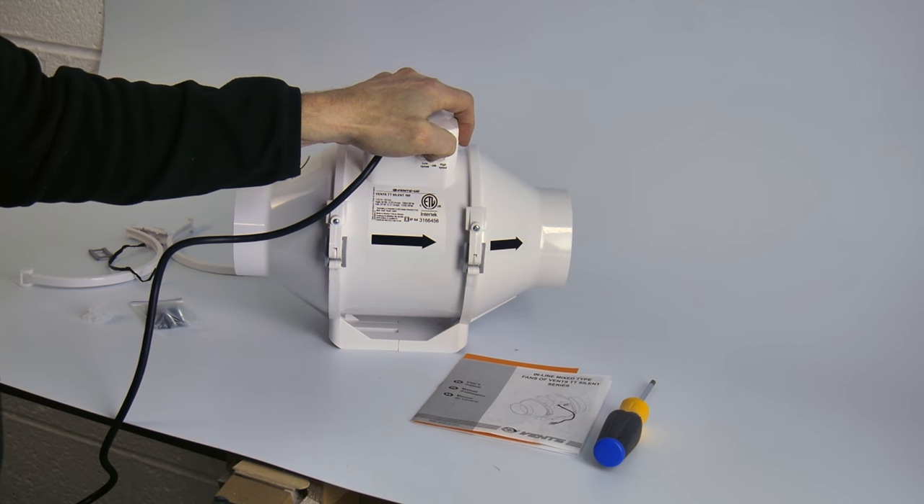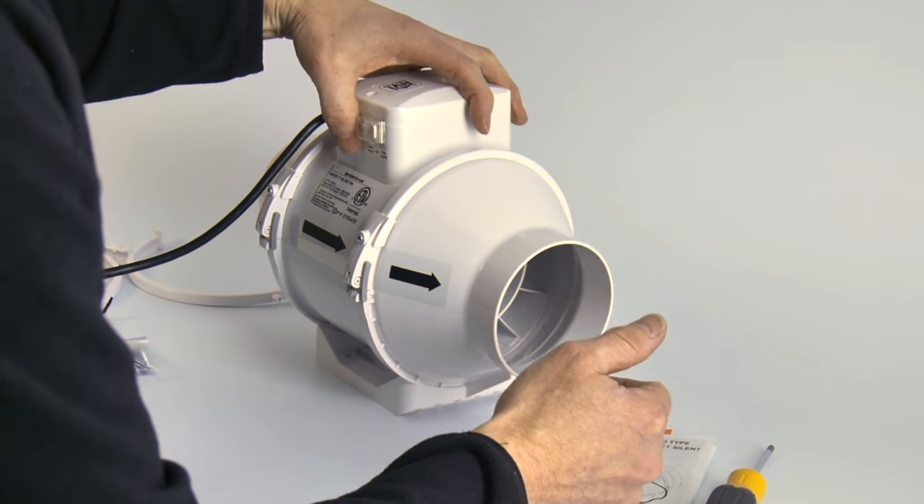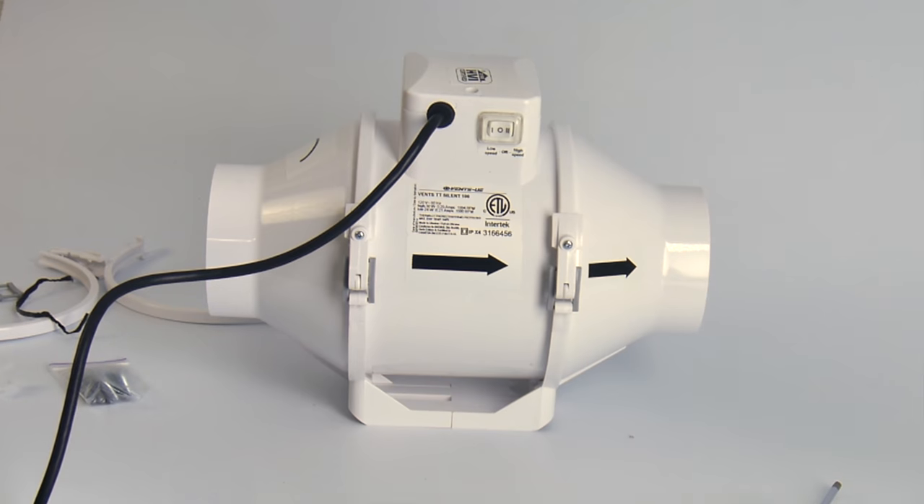I think the fan inside this unit is a little underpowered. I also don't like that it's inside the unit blowing air out — I'd much prefer a vent fan like the one I have on my spray paint booth, which draws air out at the exit point where it vents outside. A fan like that would be way more powerful than the stock one. You can smell the burning, particularly with wood or questionable plastics, with the stock fan. That's also something I plan on upgrading in the very near future — an easy mod, but something to consider.